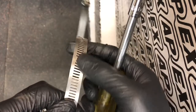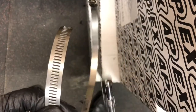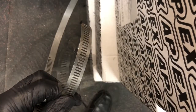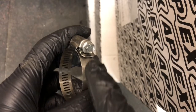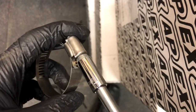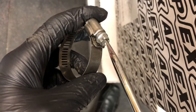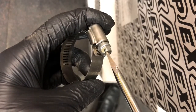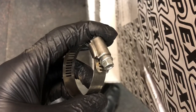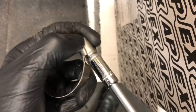One thing to note: hose clamps aren't perfect. If tightened too much, the center slots tend to dig into the material, especially on a rubber hose, so just keep in mind not to over-tighten them and damage whatever you are working on. Here I'm trying to use a flat head — I just wanted to illustrate that it is possible, however it does slip off at times. That's why I prefer to use a socket.